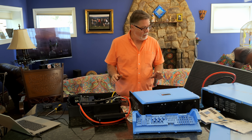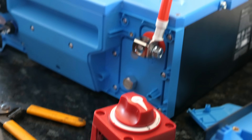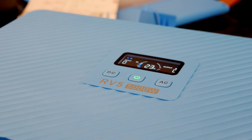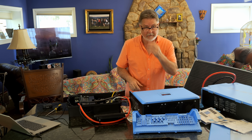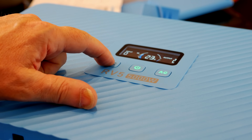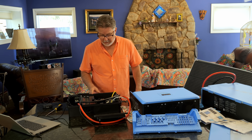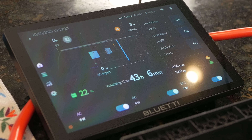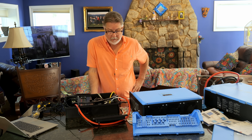Okay, I got everything all wired up — let me power this baby up and see if it works. First thing I'm going to do is throw the cutoff switch to the on position, then turn the battery on. The battery is on and I can see that the power hub now has power and is lit up, and the monitor just lit up as well. There are two switches on the power hub — AC and DC — that send power to the distribution panel. I'll turn the AC on and the DC on as well. The lights came on on the e-panel, all the DC circuits are lit, I hear a couple relays going off turning on the AC, and the monitor is showing the levels — it's at 22 percent power on the batteries. I put the solar panels out on the terrace just to make sure they were working good, and they are — I'm getting about 150 watts out of them right now.